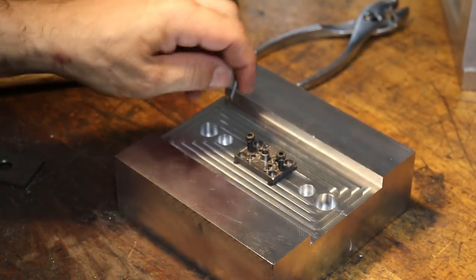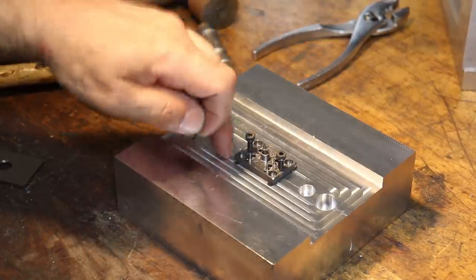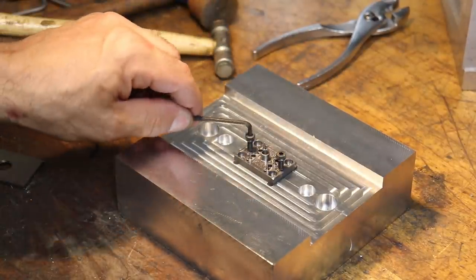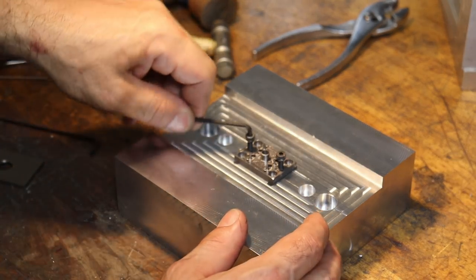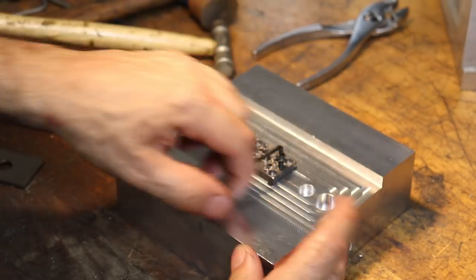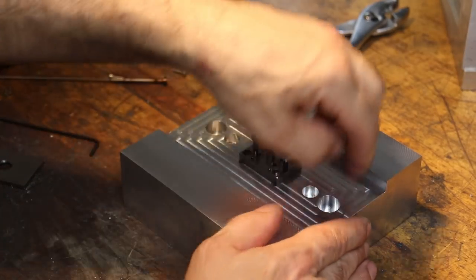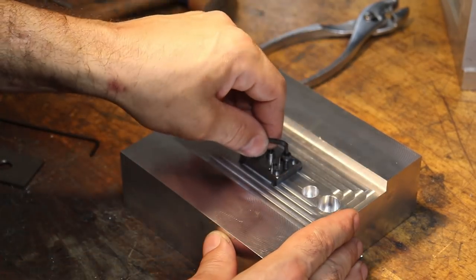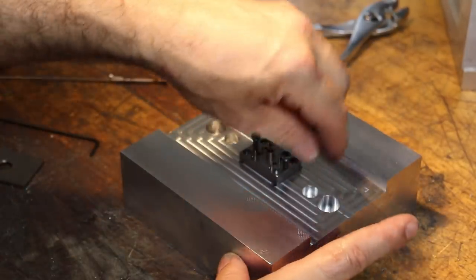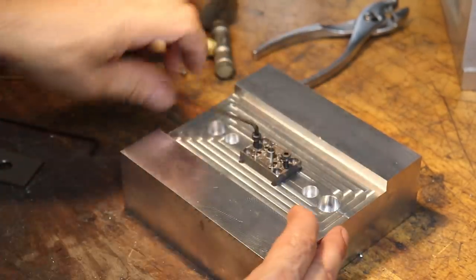But basically, you drive these jack screws down and it's threaded in the steel insert but pushing on the aluminum below it. And with the right hex key, you basically just start tightening one screw and then you go over and you tighten the other screw. And you keep doing this and you're kind of seesawing the insert out of its aluminum pocket. And eventually, as you get higher and higher up, you can screw it out more and more.